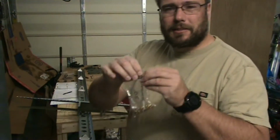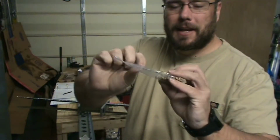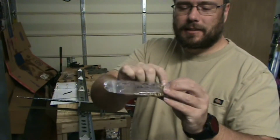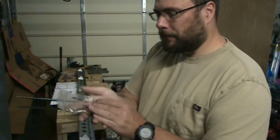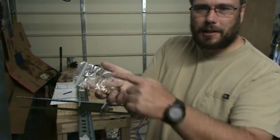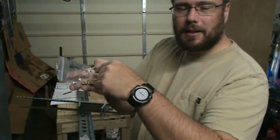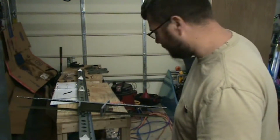One thing I like about these rivets I ordered from Vans is they wrote the size on the plastic bag. I really don't need this part here because it's obviously a universal head versus a countersink head, but the 4-5 is really useful. Instead of referring to the parts list and finding what bag number corresponds to a certain rivet size, I'm just going to write in Sharpie on there what each one is. I might also stick a tag inside the bag, because then if this wears off, at least I still have a reference in there that I can just read.